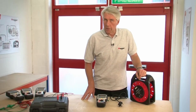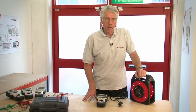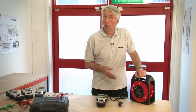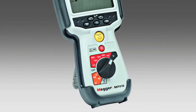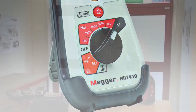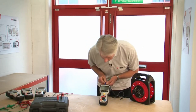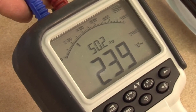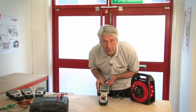Now I'm going to show you the true RMS AC and DC measurement range. While all MIT 400 series instruments are able to display mains level voltage on any range, they all have a selectable, dedicated voltage measurement range as well. Plugging into the mains supply for the purpose of the demonstration, we can see 239 volts — and it's reassuringly bang on 50 cycles.